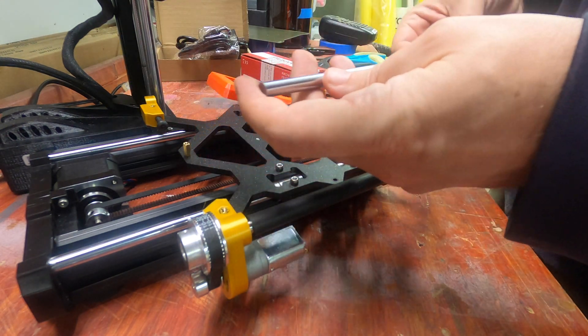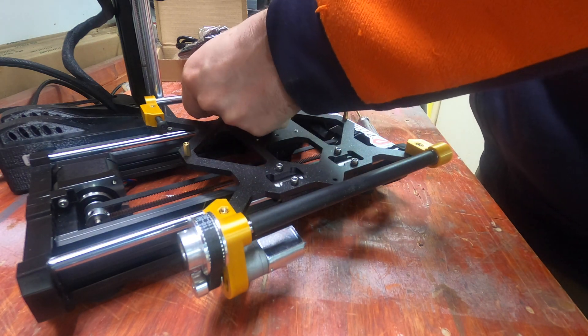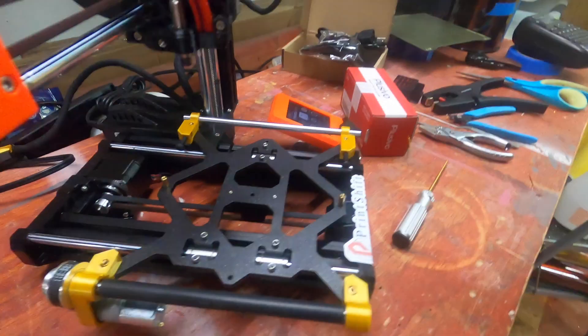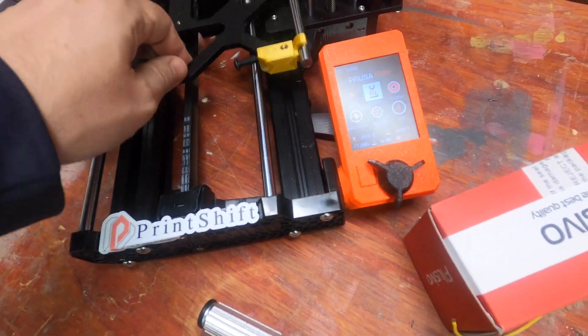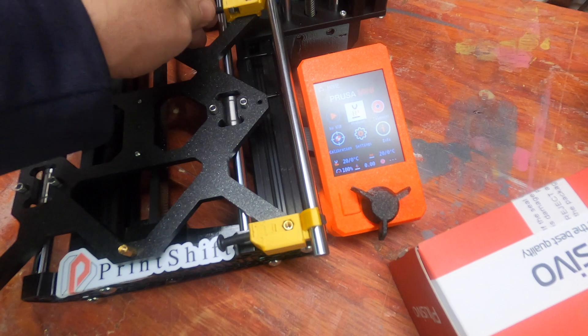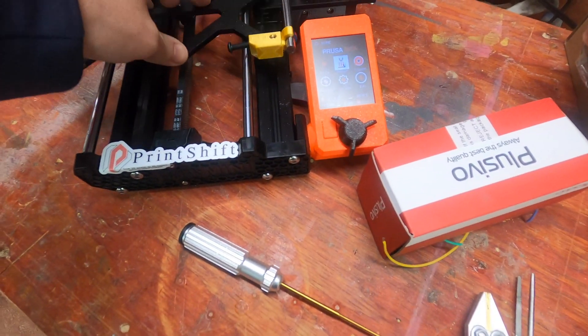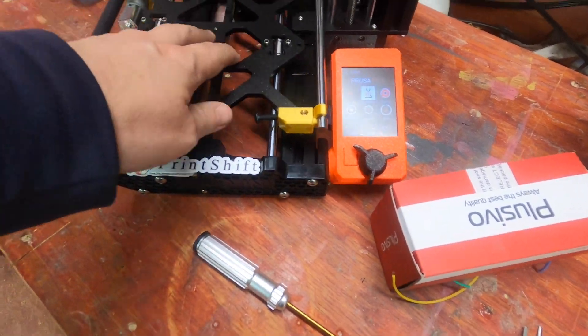Second shaft — they're both 200mm long, and we have eight hardened steel shafts. I just love the amount of clearance we get. That's the tightest point. We can only tension the rear about four millimeters before we start running into things. We clear the LCD screen by just about the same amount.